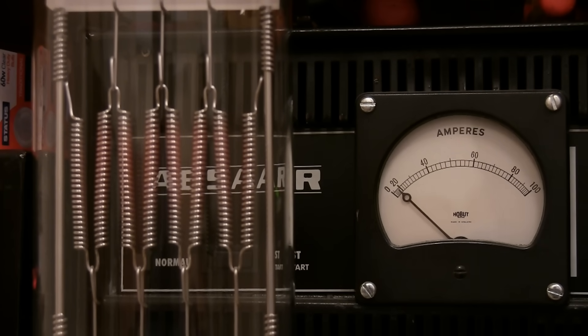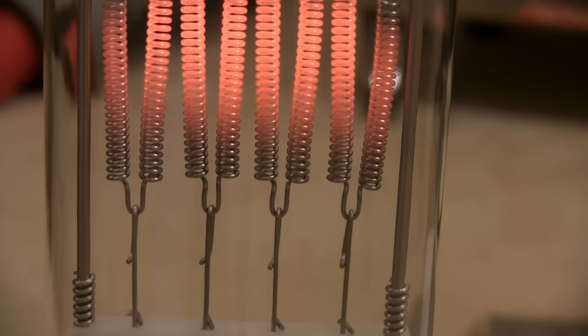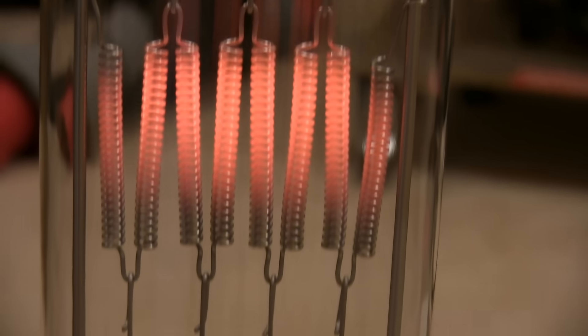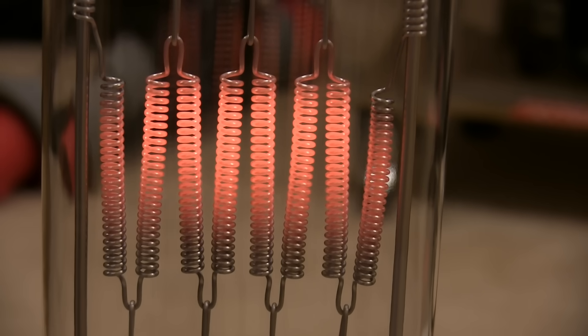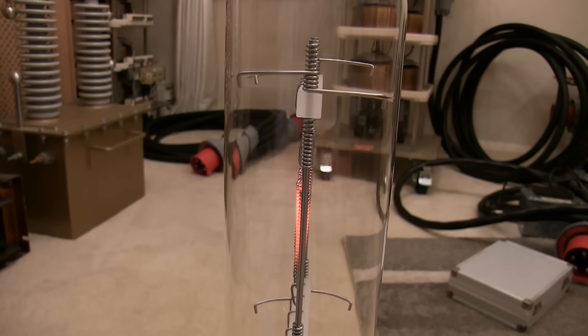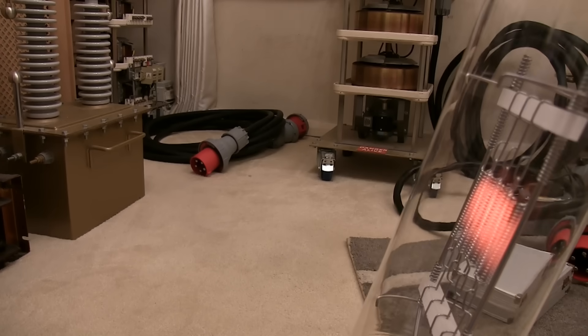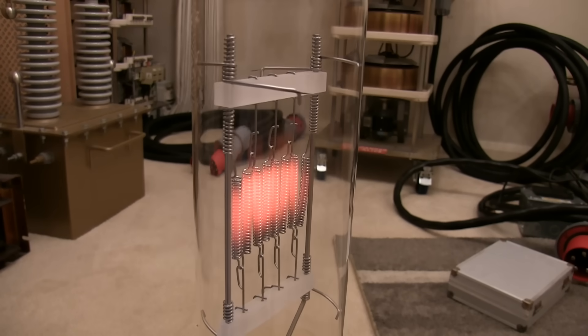I can just about see it — it is coming. I'm behind the camera and I can actually feel the heat from that on my face — that is ridiculous! But of course that's only 12 volts. The current has dropped but it is quite an initial startup. You can see the supports — that's cool. The heat's rising slightly, and the burning positions on these are vertical plus or minus 45 degrees, so it needs to be vertical or within 45 degrees.